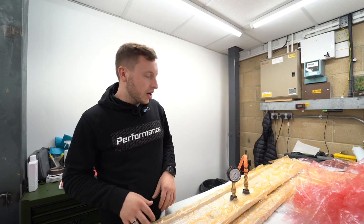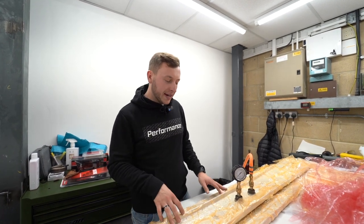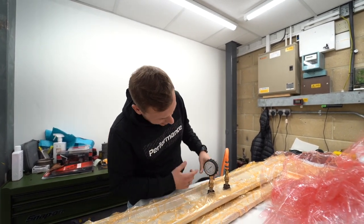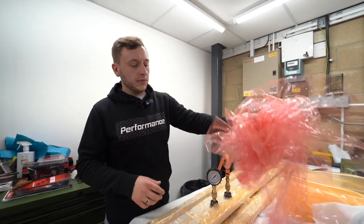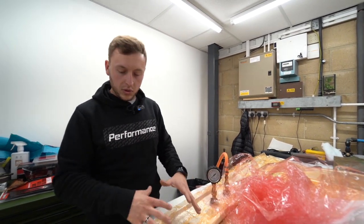All right, so we are now over onto the final bench before it goes into the autoclave. So this is the SK1. This is all bagged up, ready to go. The vacuum lines are connected. It's hit pressure, no air left inside, pretty much. But let's run through. We've got release film. As it goes in, the mold's then closed up. We then put the release film on. This allows it to be released from all of this.